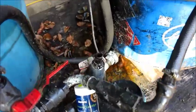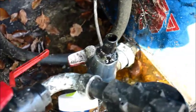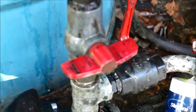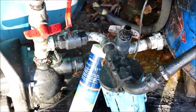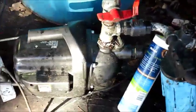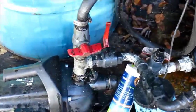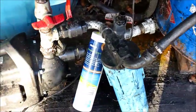I've put another fitting on the inlet side so that if I want to pump directly out of a drum or an IBC I can put a hose on it and suck the oil straight through. There's also a valve for turning off the flow through the filter and another valve for turning off the other return side. I don't always want to be filtering straight away — if the oil has some fats in it and it's cold, it will block the filter very quickly. So I usually let the oil circulate a bit to get some heat into it from the motor and the veg oil burner first, and then it flows without clogging. The other valve is useful when I'm pumping out finished oil into drums, as I can get the full pressure.